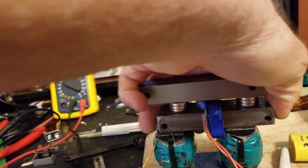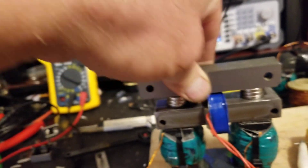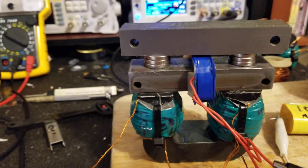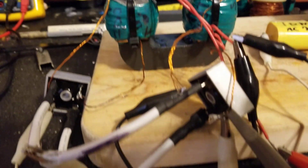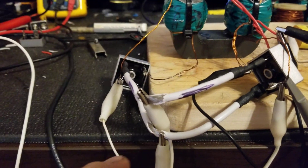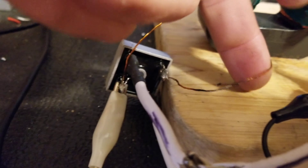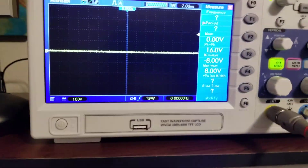But I'm going to put this bar across it, just get that down there, slide that over. No more attraction — there's hardly anything sticking. Not to just take my word for it, you can see it pulls off right. Nobody can deny that. So here is the negative on this one, and here's the positive on that bridge on that side. The AC windings are coming in here — there's the AC winding there and another one there. This is the scope probe, so we're just tapping off and looking at one up here in a minute.